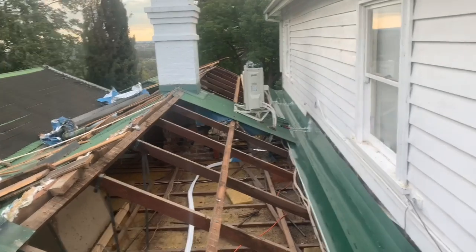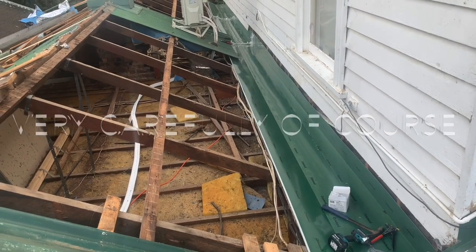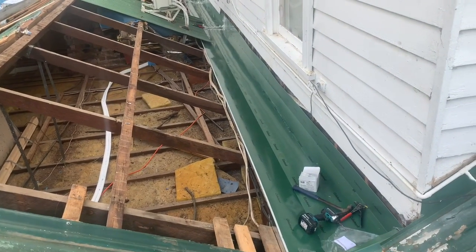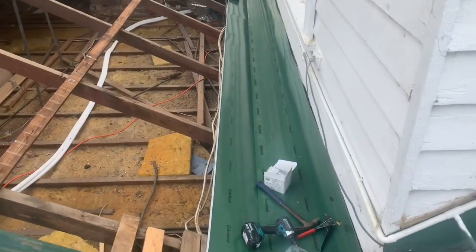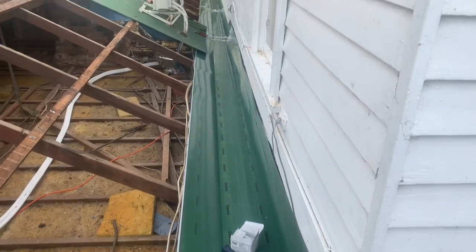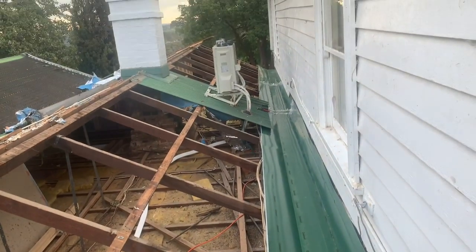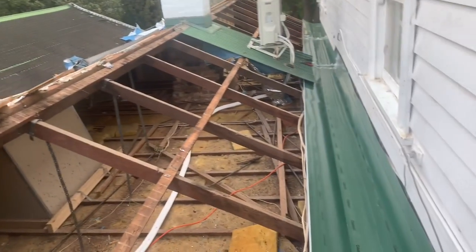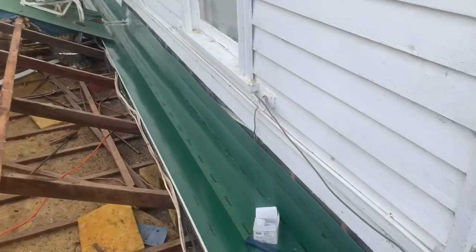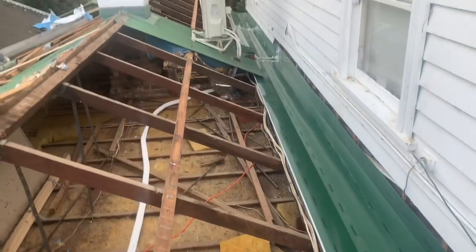It's four o'clock — I've just about run out of time, didn't have time to get any more videos in. So I slapped the board down, put some screws in it. Then I had to work around this gutter — it was custom made, so I had to get the timber board installed according to the dimensions of the gutter. It's wider at the base at this end and narrower at the base down that end, and that accommodates for the fall. I'm going to leave the bottom batten off and just run some of the existing sheets back, temporarily screw them down, because this is getting re-roofed again next week. I'll have to come back tomorrow and seal it a bit better — we're going to get a little bit of rain tonight. I'm going to get my skates on now and get it all finished.